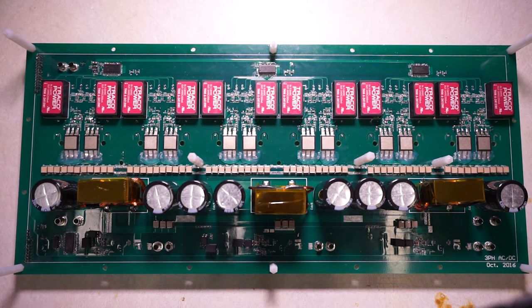The footprint of this prototype is 17 by 7.5 inch square, and the height is 2.4 inch, including the space reserved for heat sinks. Based on the proposed critical mode soft switching modulation, switching frequency is above 300 kHz.